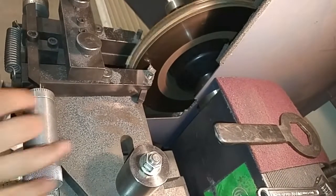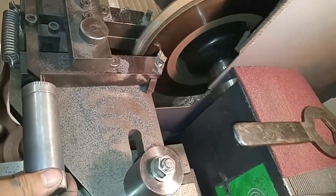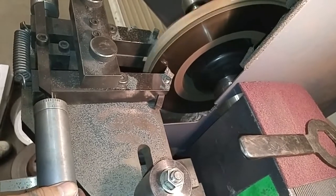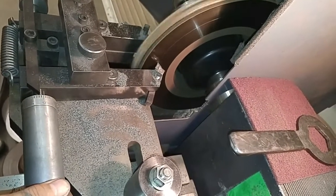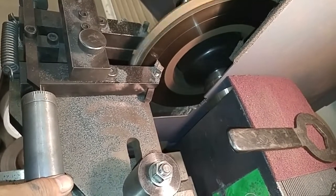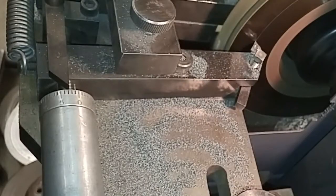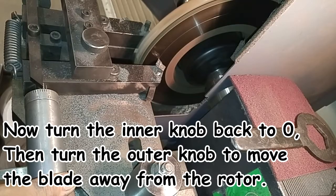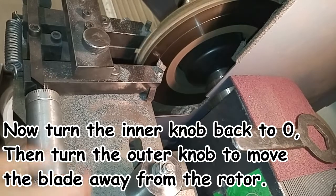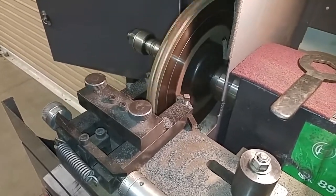Right here is where it's touched. I'm going to see how many notches it takes to make a concentric cut. This one only took around three notches. Now I'll adjust my cut to zero.